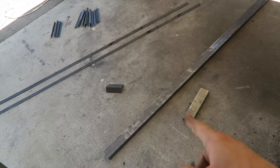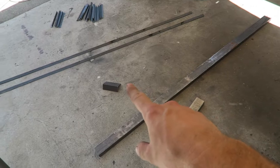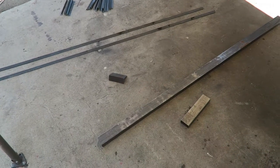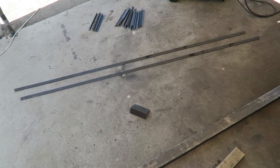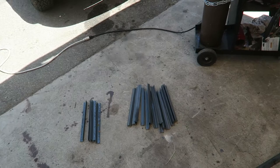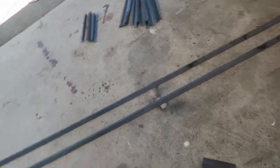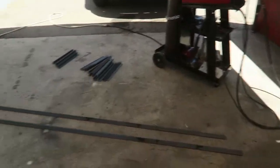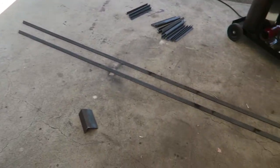Here's all my cut-out material: a 12-inch piece of rectangular tubing, an 87-inch piece of rectangular tubing, a scrap piece of angle iron that's pretty thick, two 8-footers of the inch-by-3/16ths angle, and then twenty 12-inch 3/16ths angle pieces. Now I'm going to get all these, line them up, and lay them out. I got this soapstone — I'm going to mark every 5 inches along that angle, lay all those out, tack them into place, and make sure everything is nice and square.